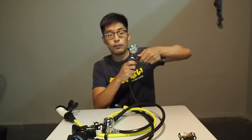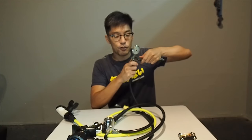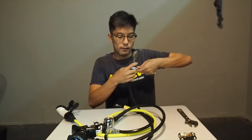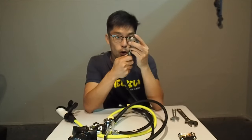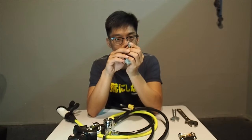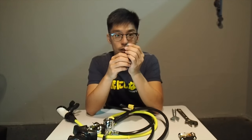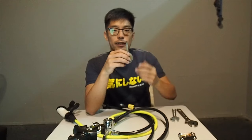For regulators you have been using for a long time, it might be a little difficult to open, but you will need some strength. Twist it until it is loose, then screw it open. What you will see is this O-ring — this O-ring is actually the key to a leaking gauge. There could be various reasons, so the first thing to check is this O-ring.